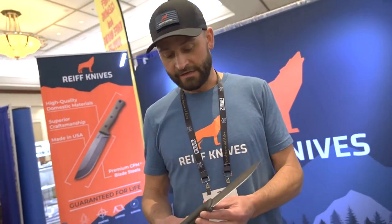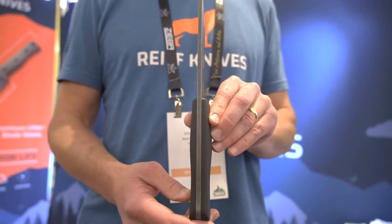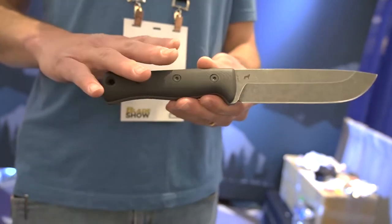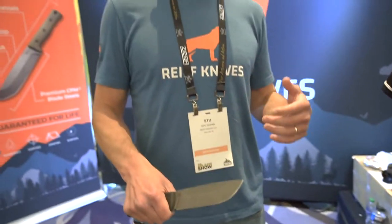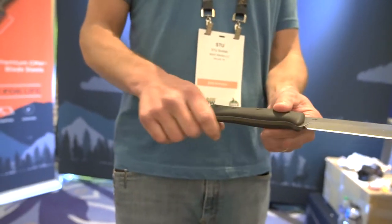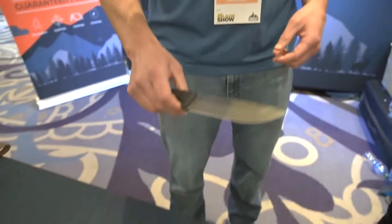Talk us through your model lines. We kicked off the company with our F series. This is our F6 — it has a six-inch blade with a five-and-a-quarter-inch handle, 3/16 steel stock, CPM 3V at 58-60 Rockwell hardness. It's designed to be your all-around camp knife, able to do any task. A lot of times with a six-inch blade it's really blade-heavy because guys are trying to make it a small chopper. We didn't do that — the balance is right over the index finger, so it's able to chop because you can choke back on this handle and really get good power behind it.